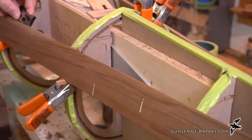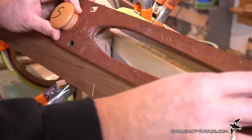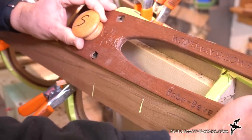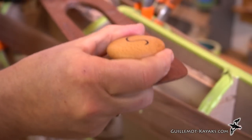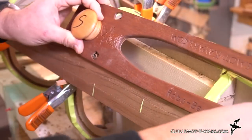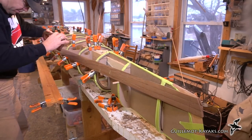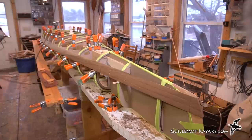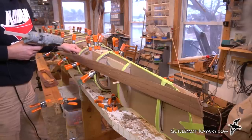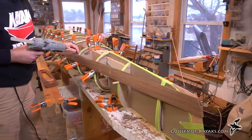We're just manually holding this plane. It's hard to estimate that angle in between the forms. The robo bevel lays up against the forms and lets you get the angle between them. If you need to twist the tool a little bit, that's what the holes in it are for — they make it so the whole tool will twist. So as the bevel rolls from one form to the next, the tool estimates that angle in between. It's important to keep these strips down tight against the forms while beveling, because if it springs out, that will change the relative angle and make the fit not quite accurate.